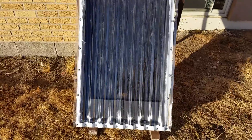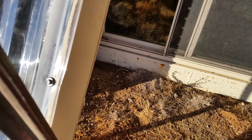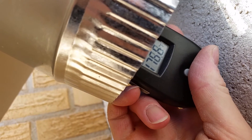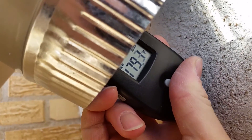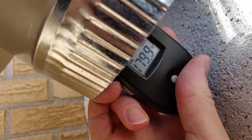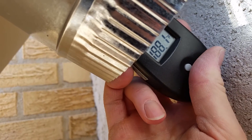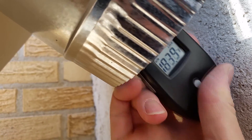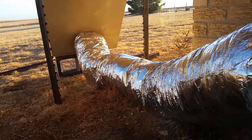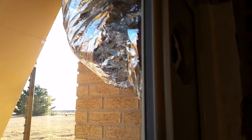So I have this mounted on the south side of my house. I have two fence posts that I drove into the ground with a post driver, and I plan to secure this on the sides using two conduit straps. The air coming out of this thing is around 180 degrees — it's about 1:30 in the afternoon and in the high 40s right now, but almost 190 degrees. I attached the 6 inch diameter flexible insulated ducting, which I believe is R8 insulation, with one duct going from the inlet up and another coming down to the outlet.